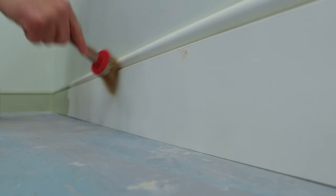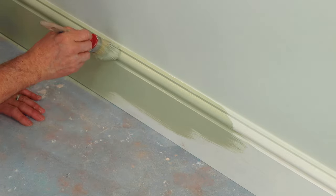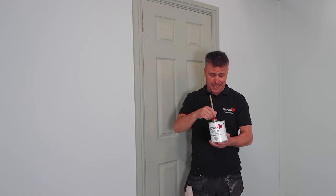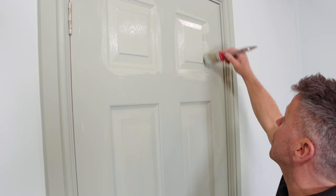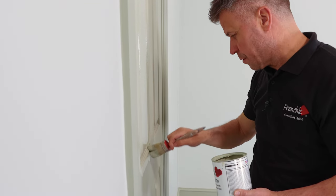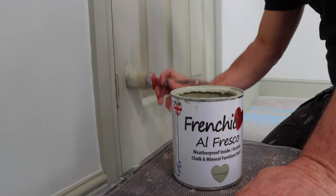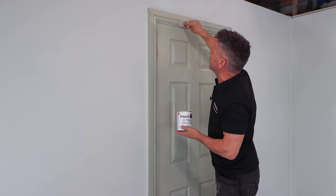It's not a bad idea to have an old paintbrush to dust the areas down before painting, as dust can build up in these areas quite quickly. The first coat has had two hours to dry — it's certainly touch dry and I can recoat it in normal conditions. I'm going to apply my second coat in the same order as the first. A 750ml tin will provide a single coat for up to 12.5 square metres. For a durable finish, a minimum of two coats is required, so your 750ml tin should provide full coverage for just over 6 square metres on non-porous surfaces.